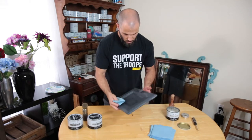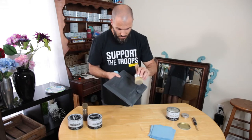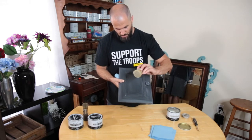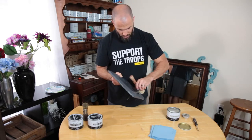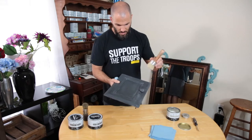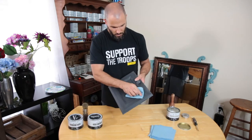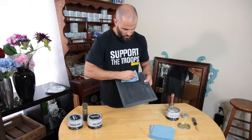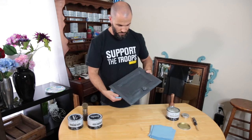So, all right, if you can see, I got some wax stuck in the cracks still. So basically take your brush after you're done with what you're doing last and just kind of dig it in there and pull it back out, and then turn your brush around to another side where the wax is still built up on your brush from pulling it off and go over down to that corner. That'll happen. I'd rather have the wax get into all the paint spots than not, and then have to go back and do this little second step that I do with the corners just to make sure all the paint got sealed, because ultimately that's what the clear wax is primarily doing. It's sealing your paint, protecting your finish. That way, whatever fun stuff you do over top of it is protected real good. So, there it is.